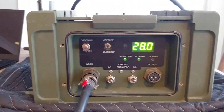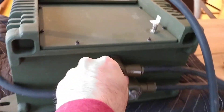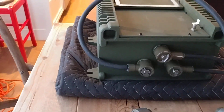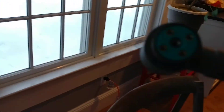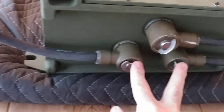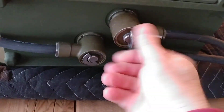So how do we get the output of this thing? Around the back you will see three standard military connectors. This comes with three cables. You've got two output cables — this is your traditional power output style cable, and it's got two of these, so the bottom two are output. This top one is an input cable, and you can tell by the gender of it — it's got a male input.